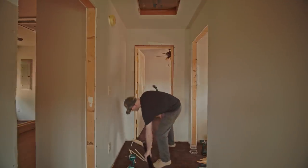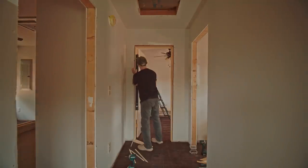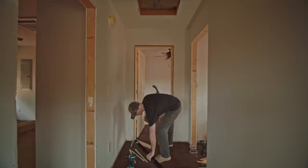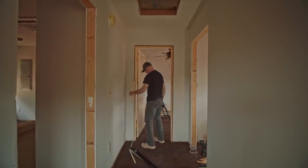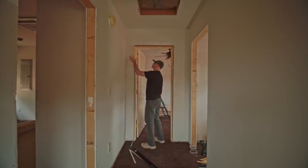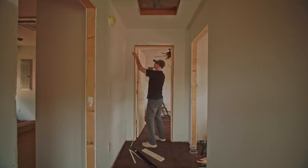I didn't feel very good, but now I'm just checking things for plumb — how it's looking so far. It's not perfect, but I'm checking how much off I am and I'll be adjusting everything. Here I'm checking how my trim would sit on the door jamb to see if I have gaps, because the trim on this side is going to be one-by-threes. Now I'm adjusting it to see how close to plumb I can get it.